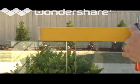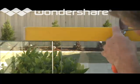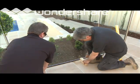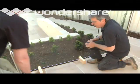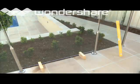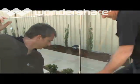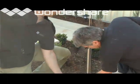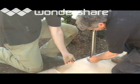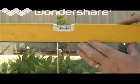Make sure the next glass panel is level to the previous panel and the gaps are even. If the glass is not level, use wooden blocks to elevate the glass so you can modify the post supports to fine-tune the levels. If you have to raise one side of the glass, cut small slices of the rubber block to help prop up the glass to the desired level. Be careful not to hit the tops of the glass together, as this may cause the glass to chip.